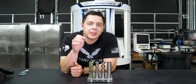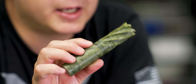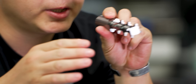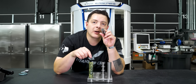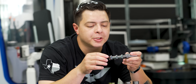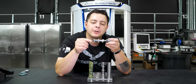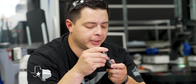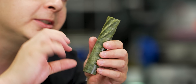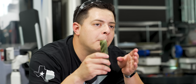Let's talk about the difference between the Jade end mill and Titan's custom multi-slot cutter. The Jade end mill had a 30 degree helix, making it a helical cutter — a square end mill. What we just ground was an axial cutter. The difference is the Jade had a 30 degree helix and this has zero degrees. I had to do an axial cutter because I wanted all the slots in line with each other, which makes it easier for my 1A1 and 1B1 wheels to come down and do the 45 degree chamfer on each side. If I tried that on the 30 degree helix, my teeth would be all over the place and I'd have to make constant movements to get there — that would take a lot of time. We're all about efficiency here, which is why I went with an axial cutter multi-slot tool.